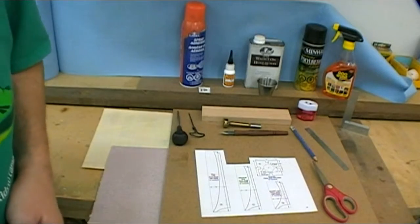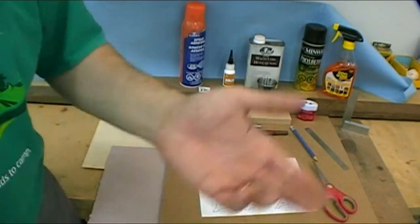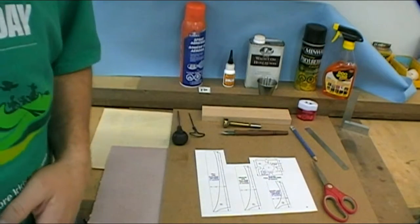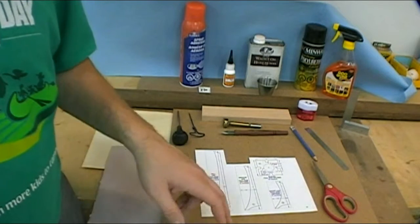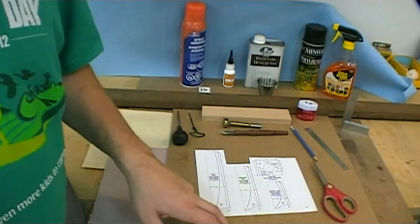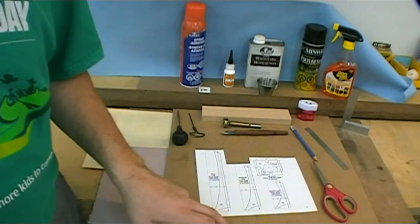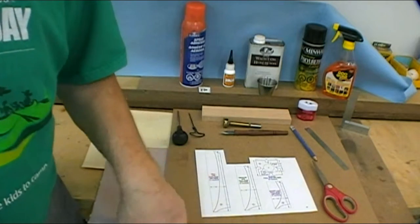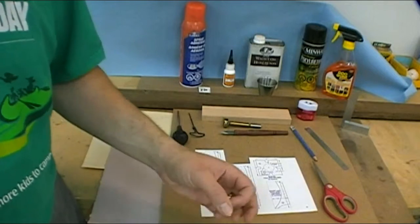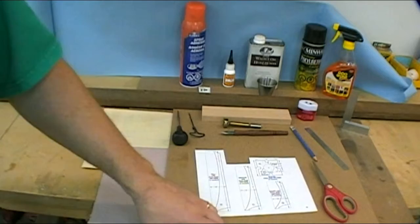And if you've seen some of my other videos, you'll see it again on my drill press. It makes my table a little bit bigger than what's available with my drill press. I also used some of this for a zero clearance table for both my scroll saw and for my bandsaw. Makes cutting small pieces easier and safer. Yeah, and it's a cheap fix. You don't have to go and get inserts and all that stuff. And it increases my table size as well, which is pretty neat.